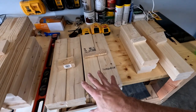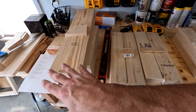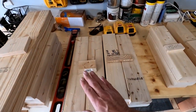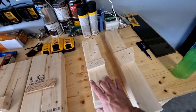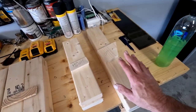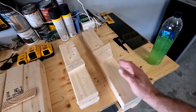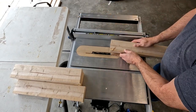I'm going to process my two by fours first. I'm not doing the top or bottom yet — we'll do those separately. I'm going to rip these edges off first, then cut down to three inches, rip the edge off one and cut it to inch and a half. Same with the crosses: rip the edge off and cut into two one-and-a-half-inch sections. I'll show you how I'm going to do that. I basically just want to take this rounded over edge off.